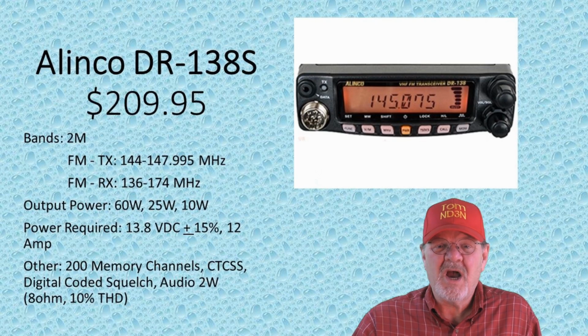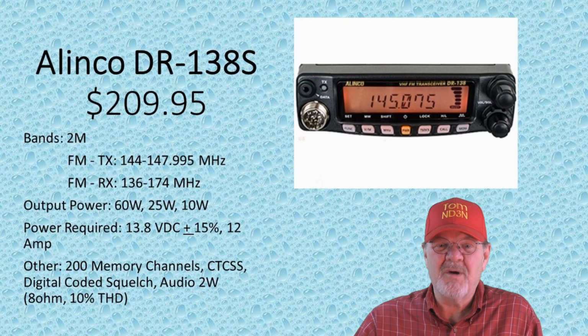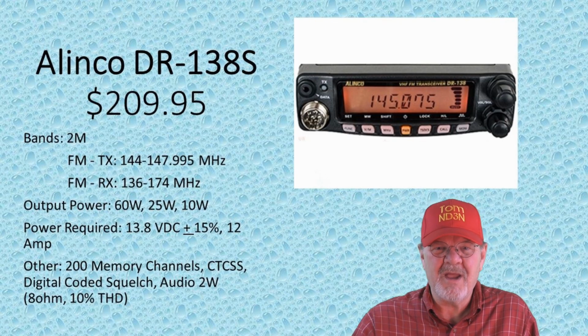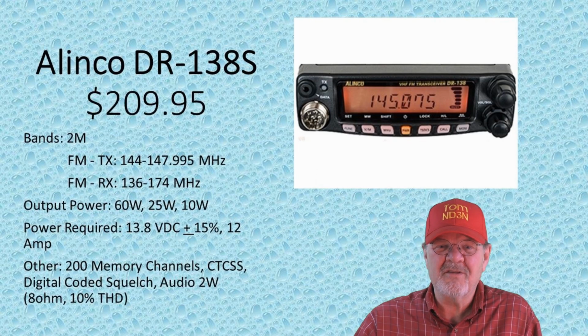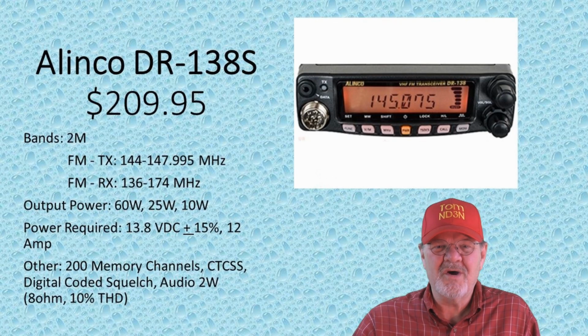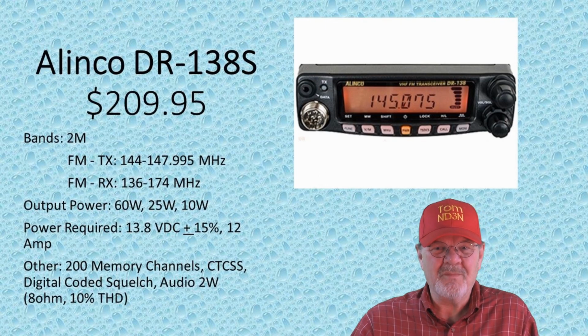The Alinco DR-138S is a 2-meter FM rig with an MSRP of $209.95. It transmits from 144 to 148 megahertz and receives from 136 to 174 megahertz. It has 3 output power settings at 60 watts, 25 watts, and 10 watts. It pulls 10 amps at high power and has 200 memory channels. It has an audio output of 2 watts into 8 ohms.